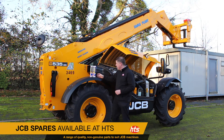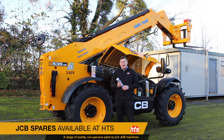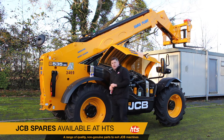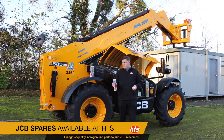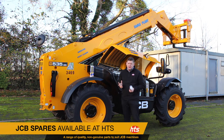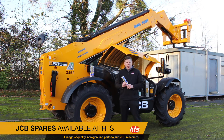Another grease we have here, which is our most popular grease and is priced at the lowest price point, is the standard brown EP2 grease. It's a high-wearing grease but doesn't have as long a life and doesn't like very high temperatures and pressures. It's good for low-pressure parts of the machine, but we recommend the complex red grease for optimum service. Some manufacturers provide the same spec in blue; Morris grease is the same spec in red. This is a long-life complex grease particularly suited for high-load, high-temperature situations and points on the machine where you need optimum performance.